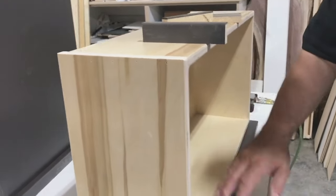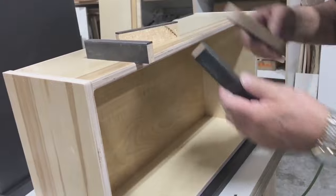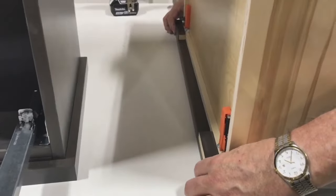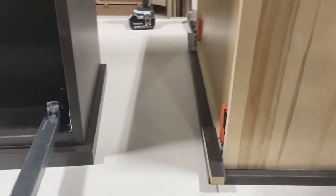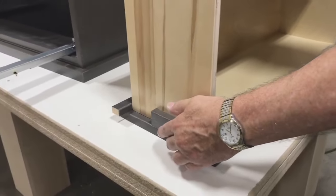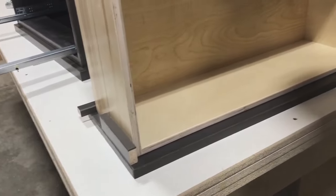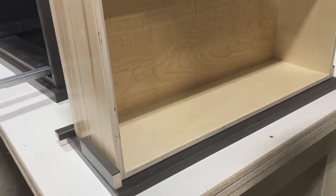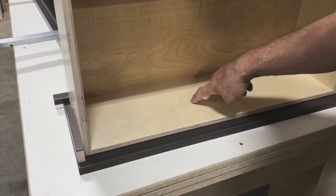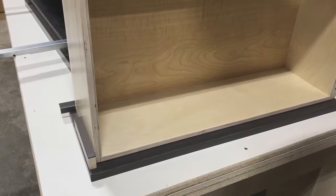We're getting ready to put the drawer on the drawer face. I just wanted to show you how I do it. We're going to be spacing with these little blocks. These spacing blocks go on the bottom, and I hold that flush to the bottom of the drawer and flush to the bottom of the drawer face. Then I have two equal sized blocks that I put on either side of the drawer and center my drawer box to my drawer face. Then I just use, this is 5/8 material, I just use a 1-inch staple, and we put four staples in the corner. What that allows me to do is, if it needs to be adjusted, I can just bump it around and adjust a little bit before I put the drawer handle on, which is what holds it perfectly in place permanently. So that's how we do our drawer faces for our initial installation.